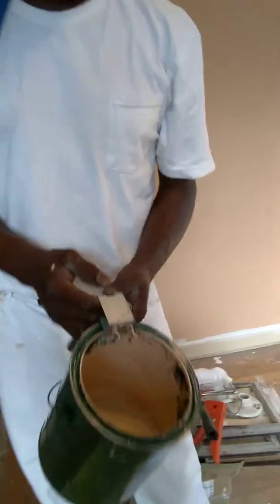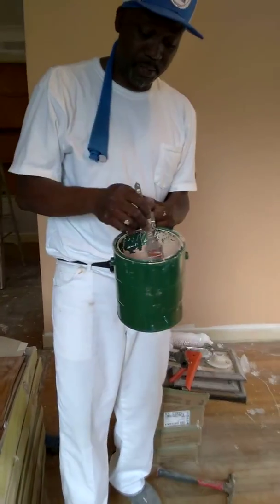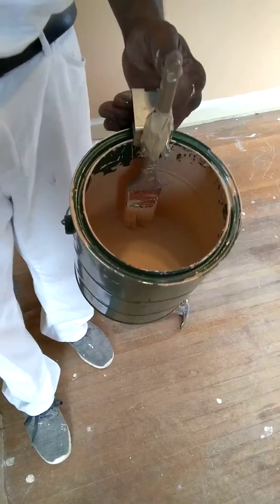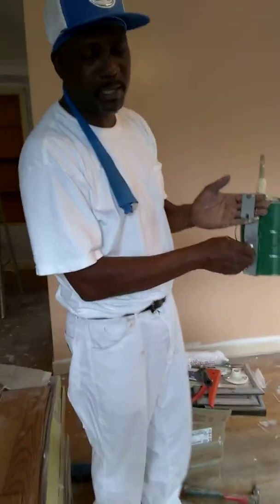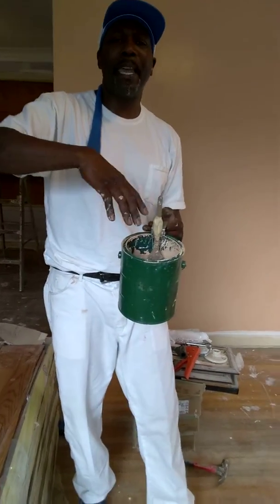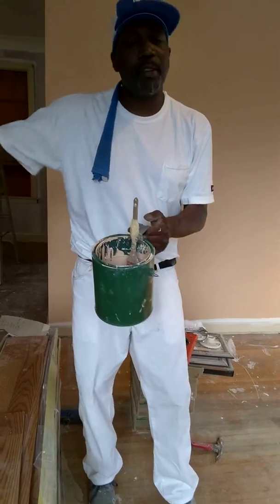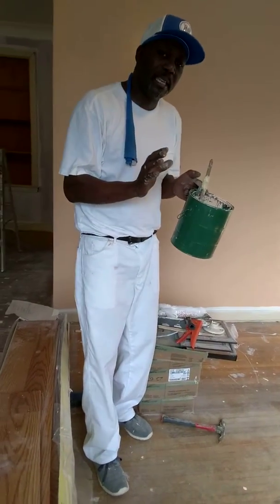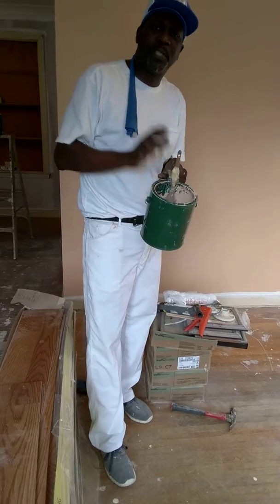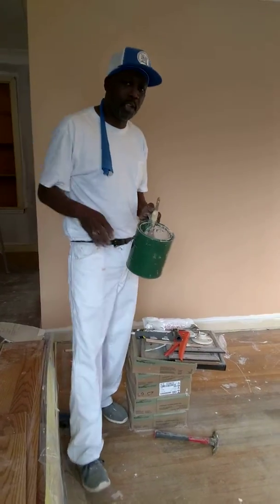Now you have a place to hold your paint brush, like that. You can put your quarter paint in there. This is my cut bucket — I never take this off. Once I put that screw in there, it never comes off. So when I clean this bucket up, clean all my paint out and clean my brush up, I take my brush, clean everything up, and I just hook my brush right back in there and throw the whole thing in the truck. It saves you time, it saves you money. And you don't have to keep a brush cover to protect your bristles — you just hook it into your brush holder and it'll protect your bristles while you're not working.